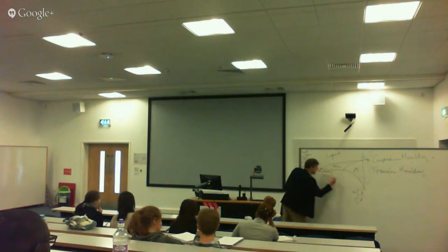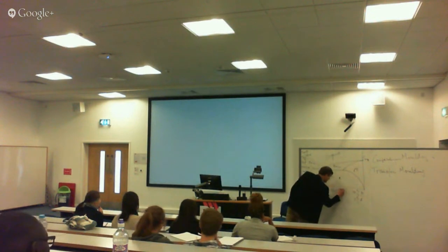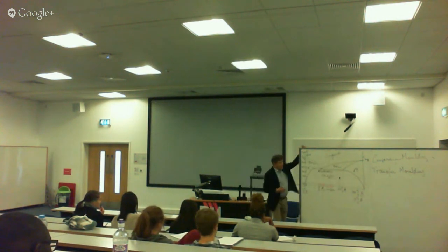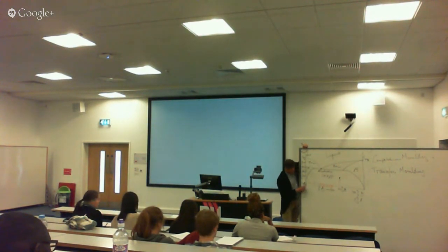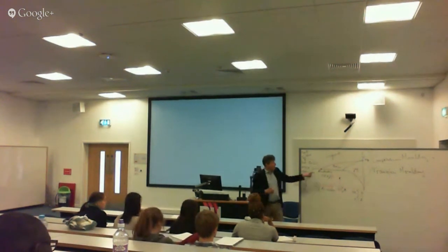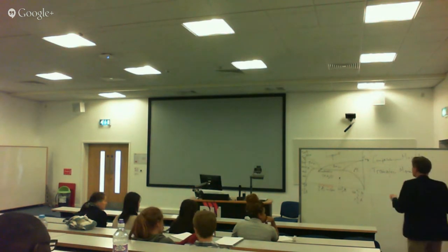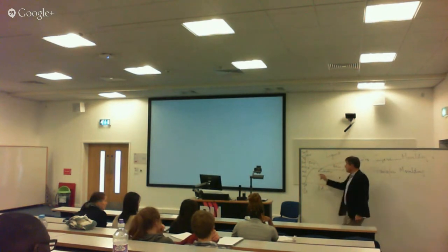Okay, what if I pick an alloy here, it's 40% A, 60% B. If I look at it under the microscope, how much of it will be alpha, how much of it will be beta? Now pick an alloy here. How much of it will be of this type? How much of it will be of that type?